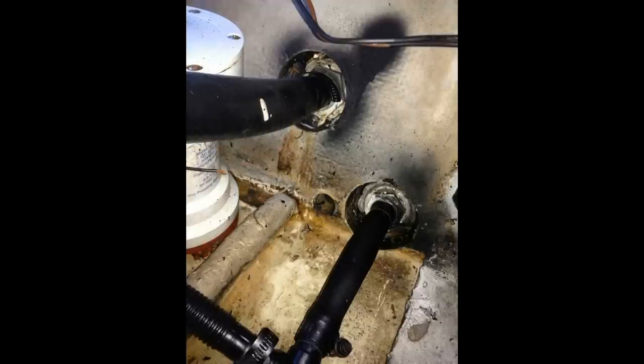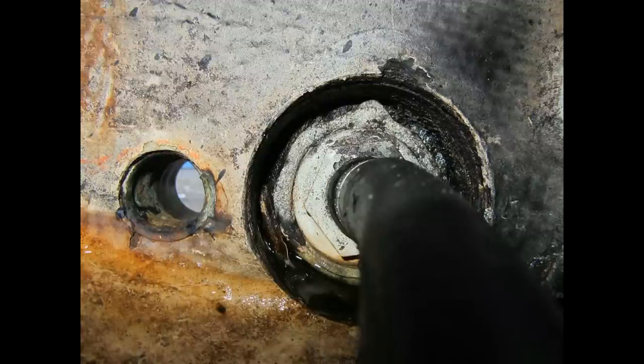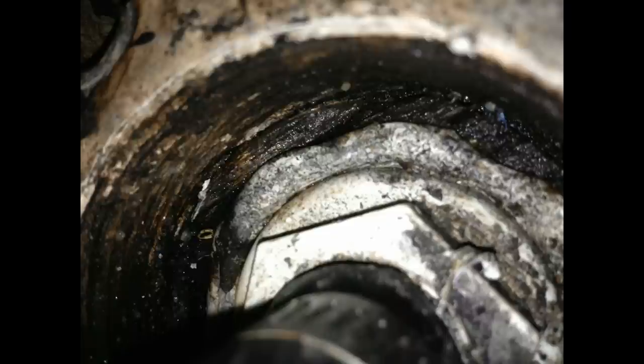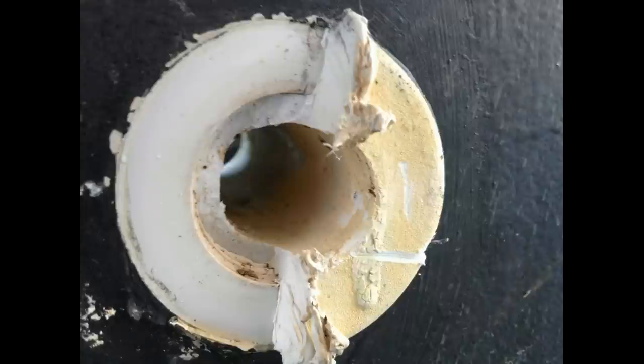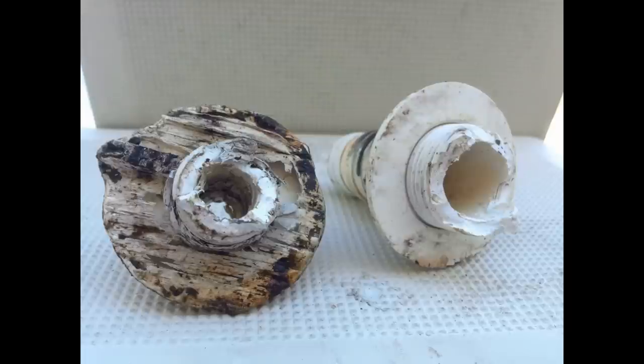Here's a look at the two holes with the old fittings and hoses attached. They're plastic and they don't have seacocks. They weren't all the way through the hole, so they were bored out, leaving exposed wood. The plan is to plug those holes, but first I need to get those fittings out. Using a hot soldering iron, I melted slots in the plastic heads of the old through-hulls, then simply broke them off and pulled the old through-hulls through. That's what's left — there are the old pathetic fittings.